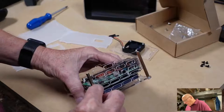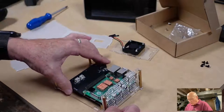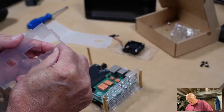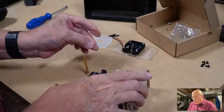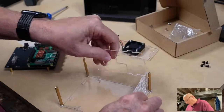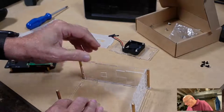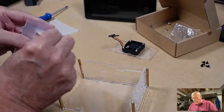Now, one of the things you want to remember with this is do not plug power into here, okay, for this setup. They have it open, but they say don't plug power into there. I'm sure there's multiple reasons why, but I think I know a couple, because it is being fed from this barrel jack connector. Now what's nice about the barrel jack connector is it lets you use some more standard, as in audiophile land, power supplies. So we can pick our favorite linear power supply, which might be fun. I don't know how that will work out. It will be an interesting thing to try, and I plan on doing that. But I think we'll start out with something that's not quite so sophisticated, and I'll show you that in a second. But I want to just get the flavor for getting this assembled first.